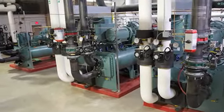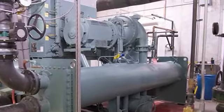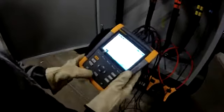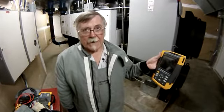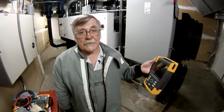This is a really nice chiller, but it's loaded with electronics. So is this whole building — the more electronics, the more harmonics. I know harmonics could cause equipment issues, but I never thought about how much more power we had to purchase to make up for the power being distorted. Now I've had the opportunity to use this new tool and I've been able to quantify and identify harmonics and some imbalances. Now I have the proof I need to present to those higher up who control the financials, and they can make their decisions intelligently on how to correct these problems.